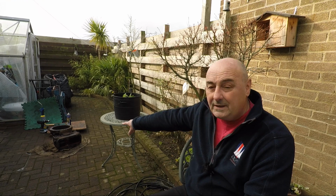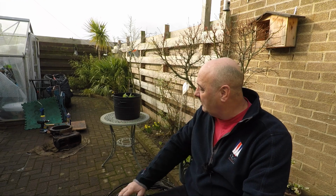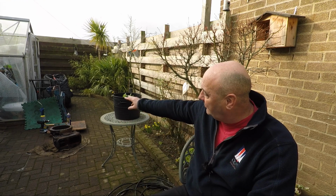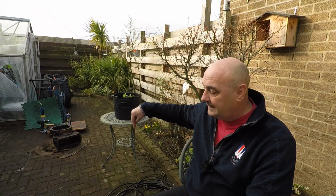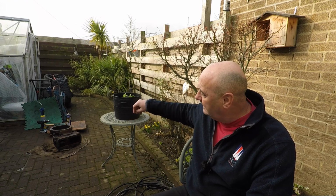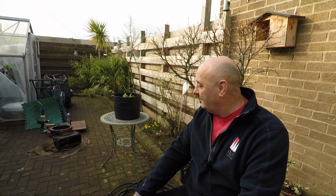Today we're going to get the 3 broken studs and the 2 stuck frozen studs out of this casting. The 3 broken ones we're going to have to drill out, so we're going to go down through the middle. We're going to try with an easy out stud extractor first, but I don't think we're going to be able to, because of the size of the bolts. Somebody sheared them off previously, so I imagine they're pretty well stuck. I'm not expecting this to be easy.